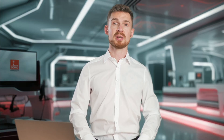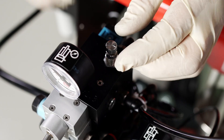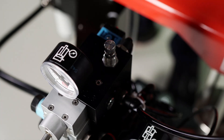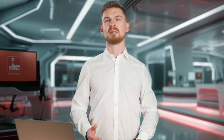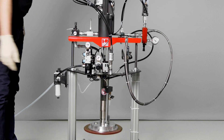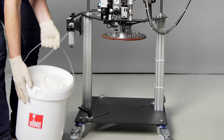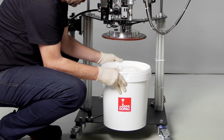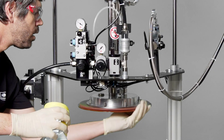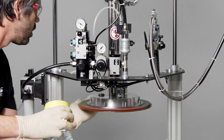The alarm volume can be regulated using a throttle if required. Next, we move the follower plate into the container. To do this, the lifter must first be extended out fully. Now we can place the container in the center. It is recommended to lubricate the dry follower plate with a small amount of material from the container or with some Vaseline.